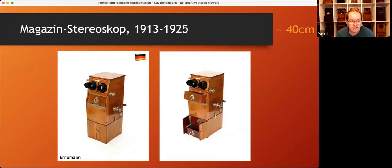The German manufacturer Ernemann took a different approach. Normally, a mechanism is mounted in a metal rack and then the entire mechanism is put inside an empty wooden box. The so-called magazine stereoscope used the wooden housing itself as a rack for the mechanism, meaning the shafts of the mechanism are mounted directly to the outside of the viewer. That's why this viewer is hardly wider than the trays themselves, as you can see on the right picture.